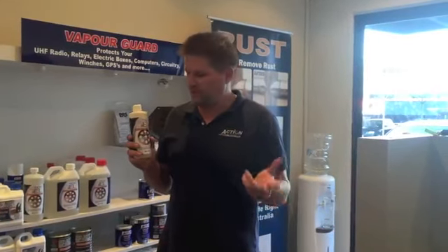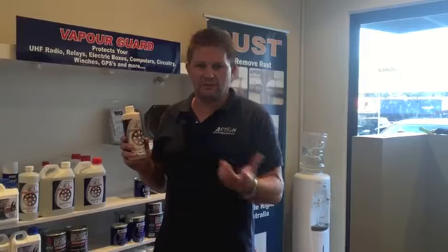The primary role of Action Gel is as a rust remover, with the added benefit of leaving a beneficial paintable surface, as per your standard rust converters. So the benefit of the gel is it's going to remove those layers of rust, and not have the problems associated with just relying on conversion.